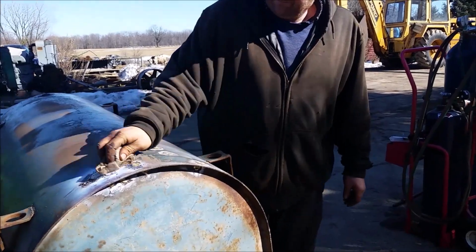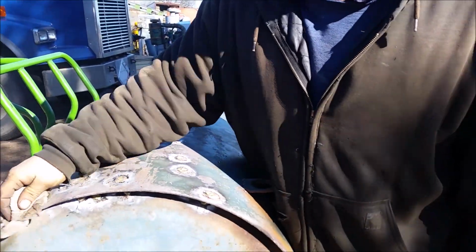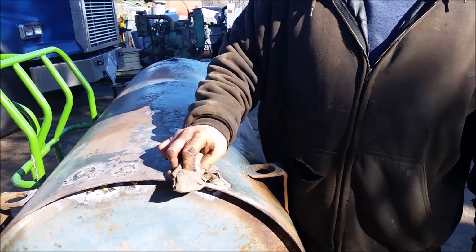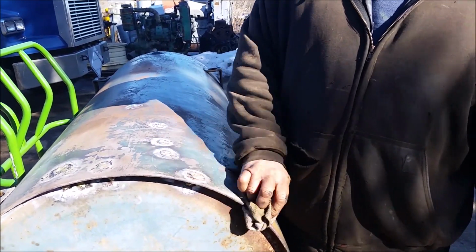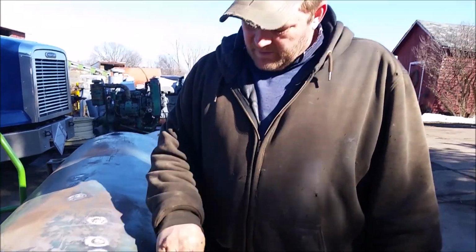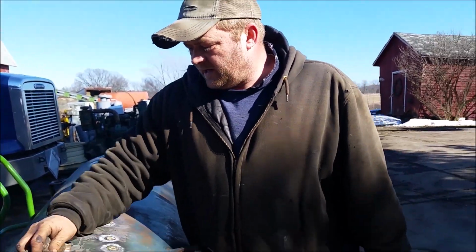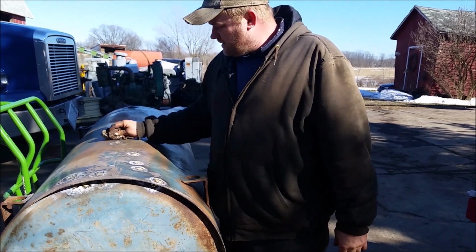So he'll smooth these out. We've taken our grinder elsewhere, so he's going to have to do it with something, maybe a file. A file does it nice, because then your grinding wheel can't get plugged with this soft metal. I like to do these with a big file and not a grinder.